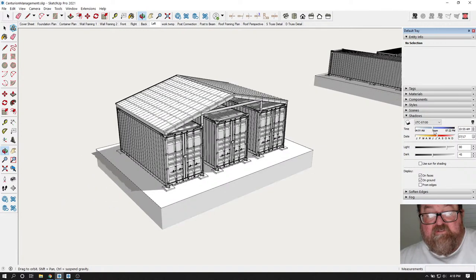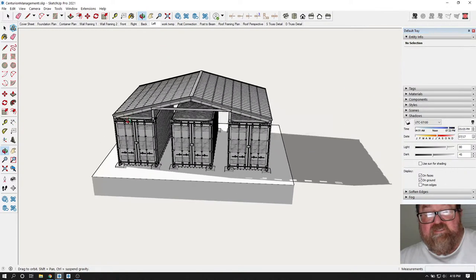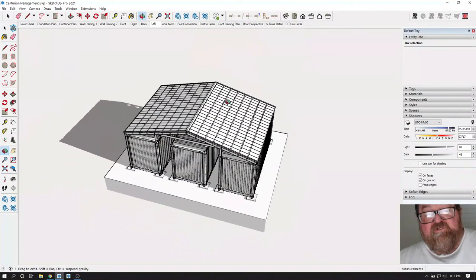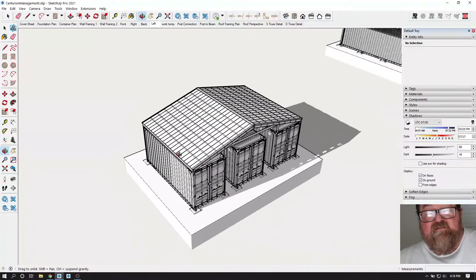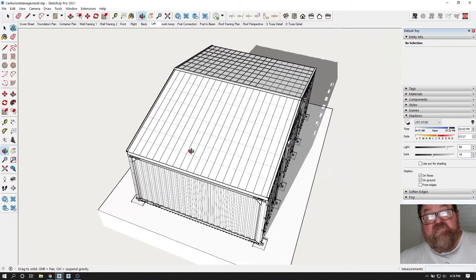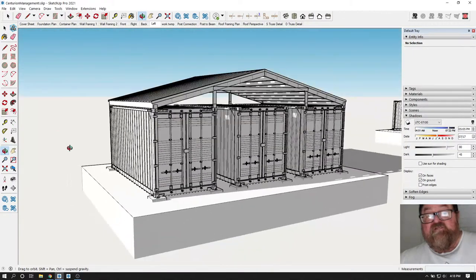And we go around. So these buildings are basically facing east and west. You might lose a little efficiency with solar panels on the west side, but the pitch is low enough on these roofs where you could put them on this east side. Although the optimal position for your solar panels would be facing south. I tried to get him to let me turn the roofs so they were facing south, but he wanted them facing this way.